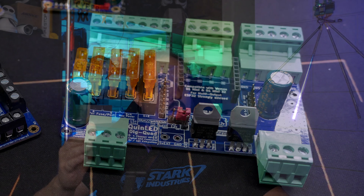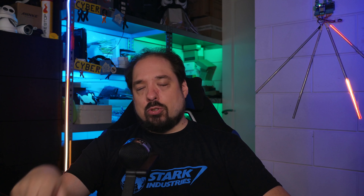I've tested the board with both screw terminals and also pluggable-style Phoenix connectors — the green connectors. While those are awesome to work with and easier to screw stuff into, and being able to disconnect the blocks is great, they are not capable of handling the same amount of power as the screw terminals can. I will have a dedicated article about using those plugs in the future, because I do think they have their place, but you just need to be aware of the different power limits. All features of the Dig Uno carry over, such as the onboard temperature sensor, multiple exposed GPIO pins including I2C to hook up a screen, or pins for a relay, a button, and extra temperature sensors — it's all still on there.